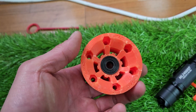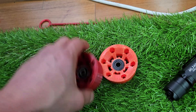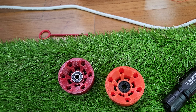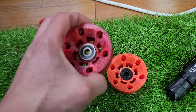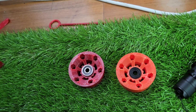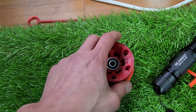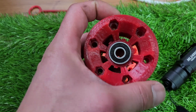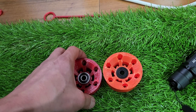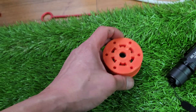I made my model at 101% and it's actually slightly bigger than the PETG, but it worked out perfect. My model was a little bit tight on tolerances, so I'm going with 101%. If you're using an enclosed Voron like I am, you can print the same model at 101% — or more exactly 100.5% when you scale it in SuperSlicer or PrusaSlicer. I don't know how the shrinkage is on open-ended printers like Prusa; it might be more. So I do recommend printing out and comparing the dimensions before committing.